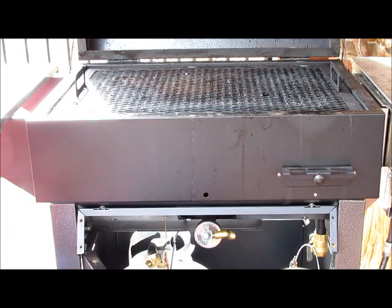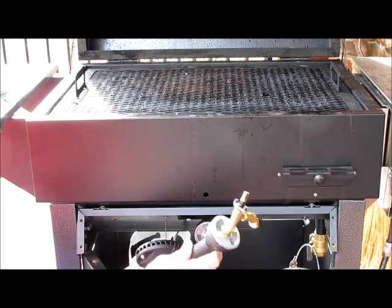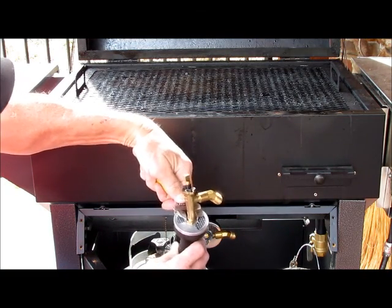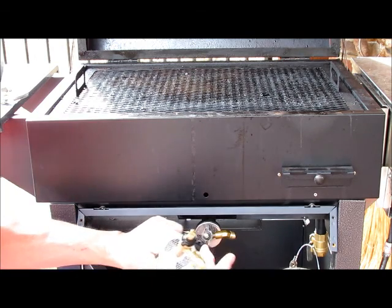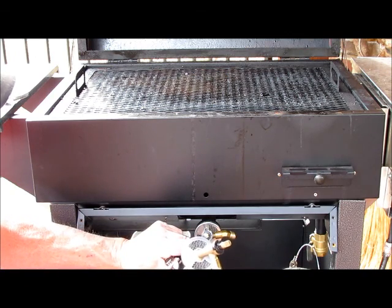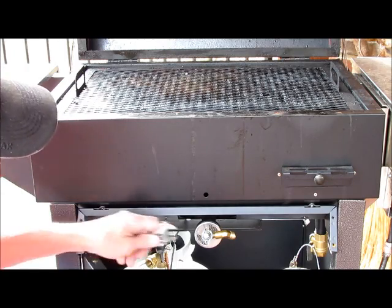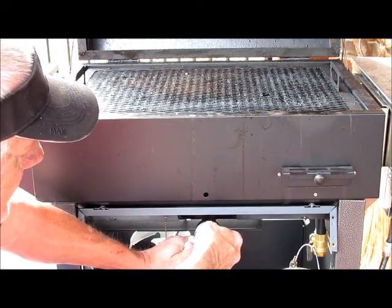Now, using a burner to show you — you want to loosen the lock nut that's behind the gas valve. That keeps it tight and firmly in place. With your adjustable wrench, loosen that a little bit and then you'll be able to screw it right out from the burner. But before you do that, take note of where your air shutter setting is, and you'll want to put it back the same way it came apart. So I'm looking at my air shutter and seeing how much it's open; I'm going to try to set that exactly the same when I put it back together. So I'll loosen this lock nut so I can take the gas valve out and change my orifice.